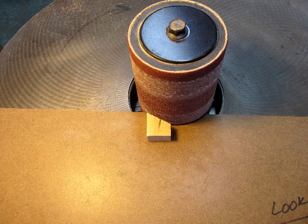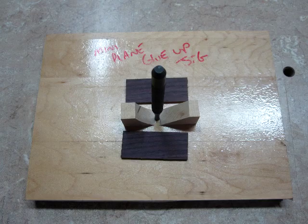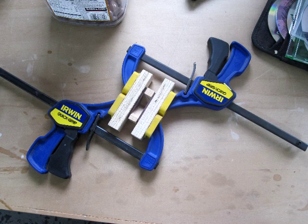I'll put a radius in the front of the plane with my drum sander. Now you can see all the components together — the pieces of rosewood for the sides I cut from fingerboard blanks. Using my jig I can hold everything in alignment with a good space between the front and back of the plane for where the blade goes. After it's glued up with a little squeeze out, we'll clean that up and set the sub-assembly aside to dry.